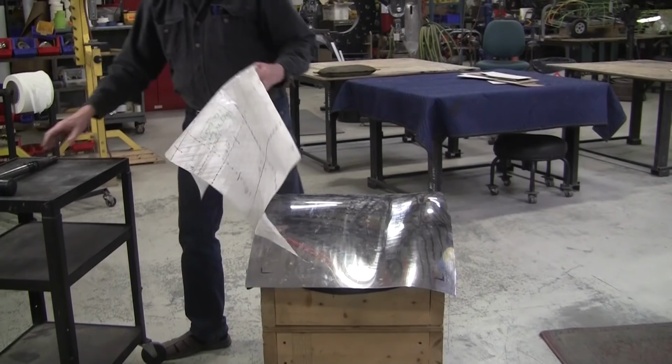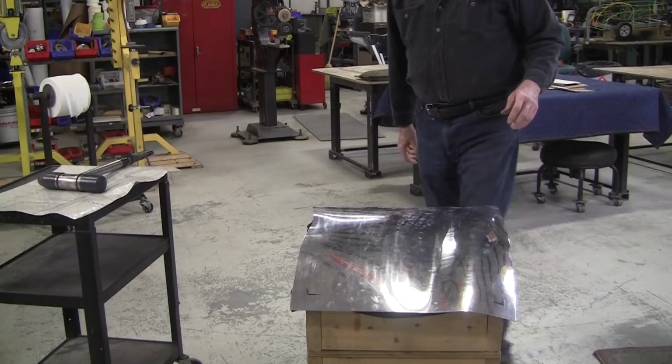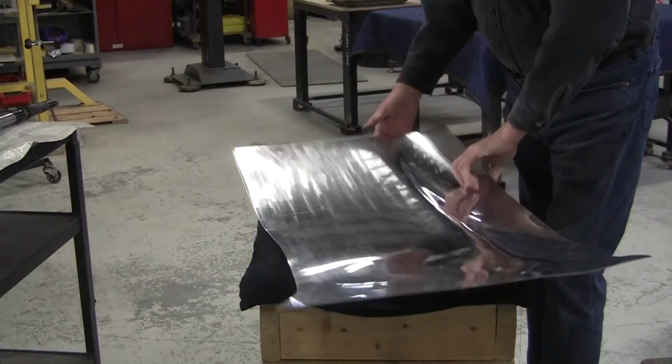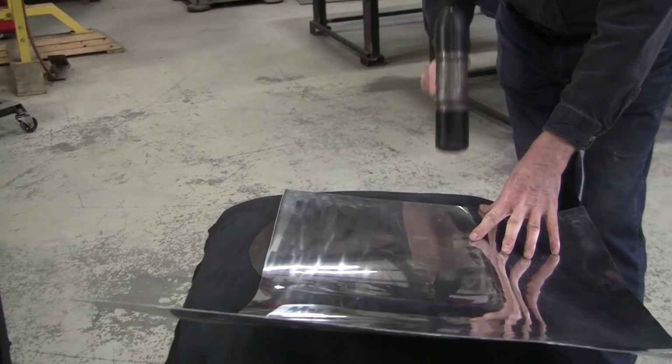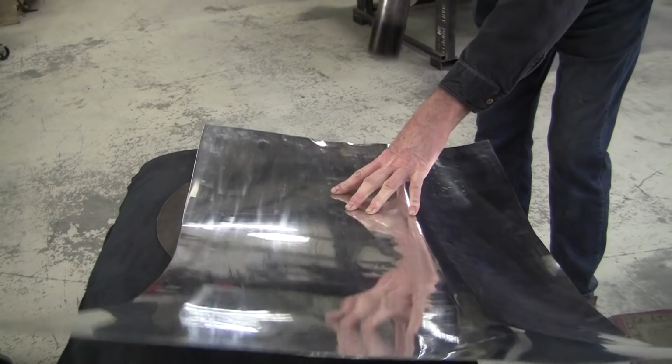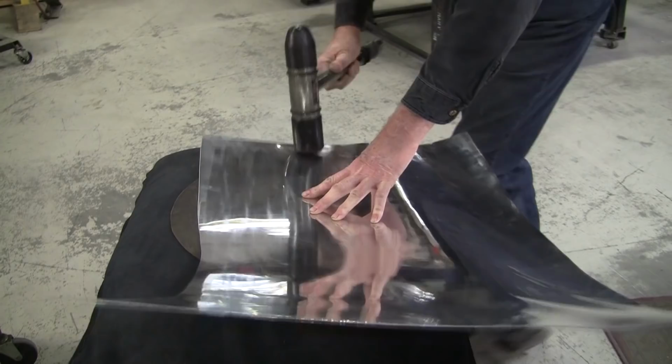When you have a situation like this, you can wheel that up, but it seems to be a lot slower when you do it that way. So I prefer just to do a little hammering or malleting and bring that up a little bit, go a little bit at a time. Now it's on the edge, so I'm going to hit it right on the edge and bring this edge up. I hit it a little bit